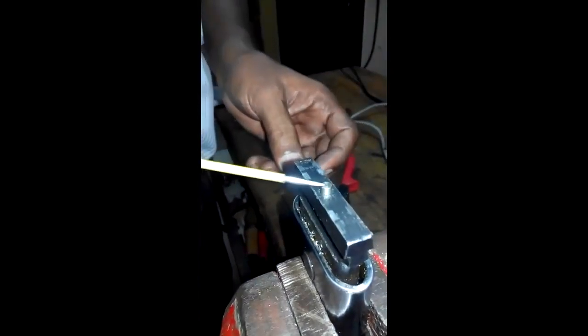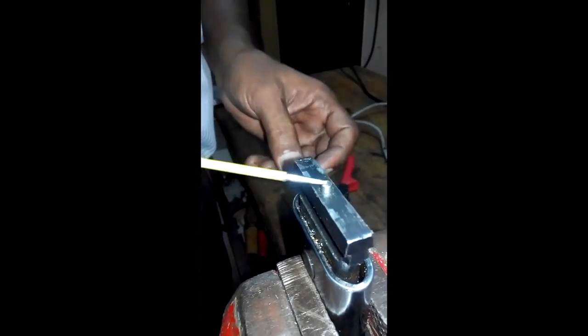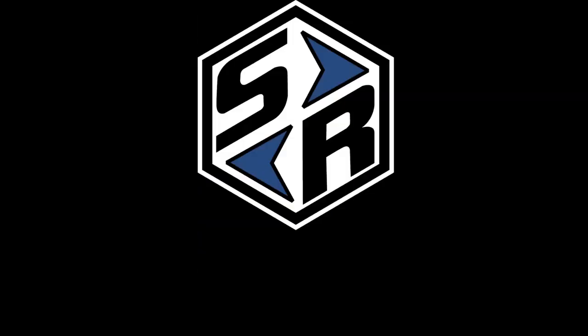This is where that flathead screwdriver really comes in handy. Once all the coils of the spring are in the hole, use your thumbs to push it down, make sure that it's seated, and then use the screwdriver to take the top of the pin below the surface of the dovetail. Make sure that it pops up properly, and you're good to go.